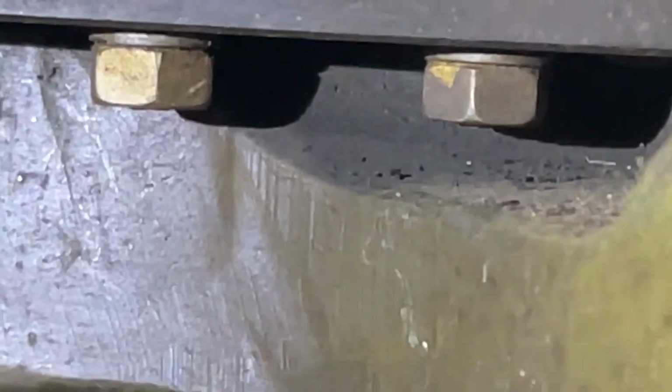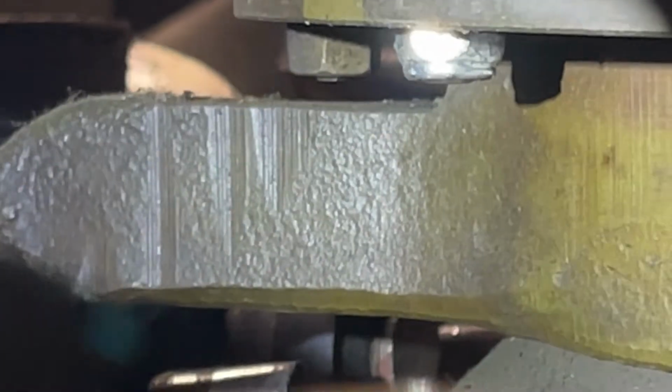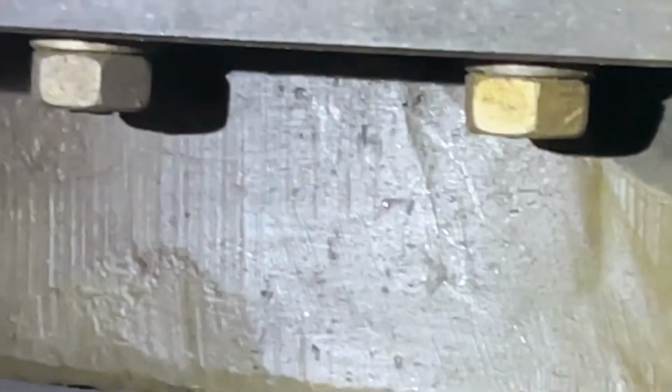that. Another one to check for is all your spoon bolts right here. See how they stick through on the bottom? Make sure that somebody didn't go in and replace one time and put one that's too long on here. You want to make sure that they're not sticking down too far. See how they don't have a lot of room between the turret frame and the bolt? But if you got one that's too long, or maybe something's coming off, that might interfere with the spider opening and closing.